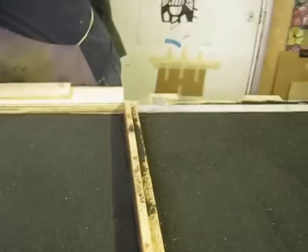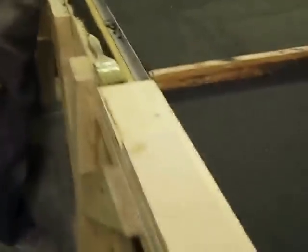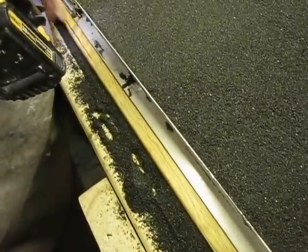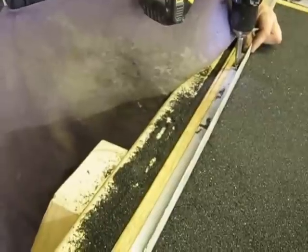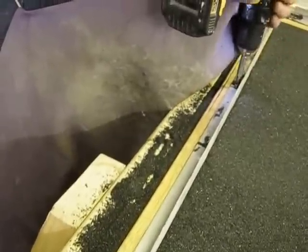The sand is level now, and we've put this upper rail on there, which is 3/4 of an inch above the bed of sand. Sam is taking a piece of 3/4 inch aluminum angle iron and screwing it down along the rail, so that we've got a dike 3/4 of an inch above the bed of sand that will hold the epoxy when we go to pour.